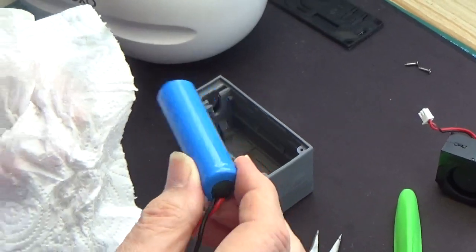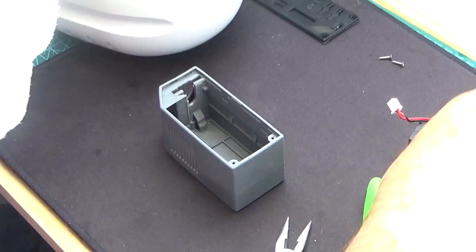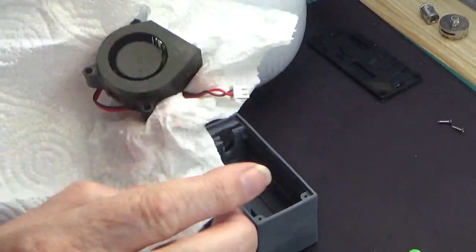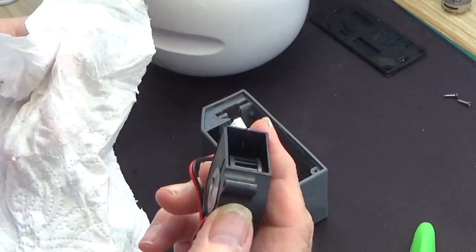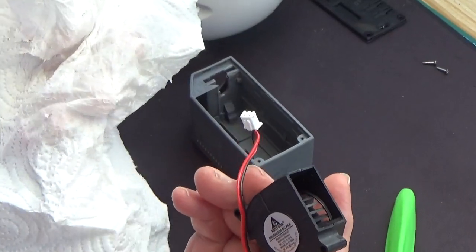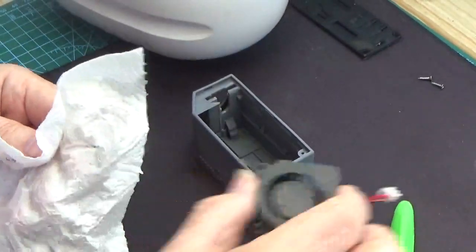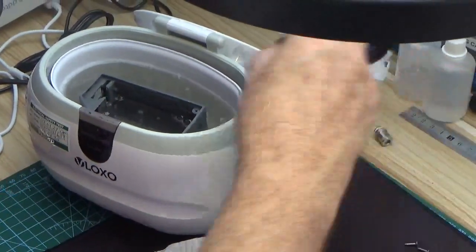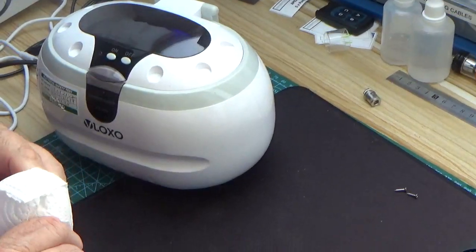Lithium batteries you have to be very careful with — just slightly damp and wipe it down; do not wash lithium. Same with the fan — a little wipe down, taking off any of the material that has leaked inside. The fog fluid is quite harmless but it is slightly sticky; it washes off your fingers with simple water — there's not even any necessity for detergent. I would then pop everything into the degreasing unit, set it going, and we've now got clean but possibly slightly damp components.